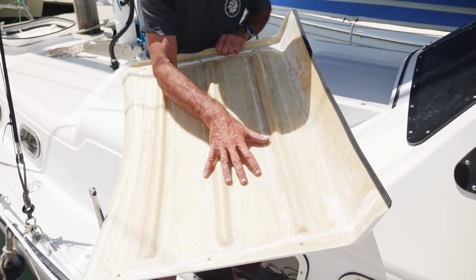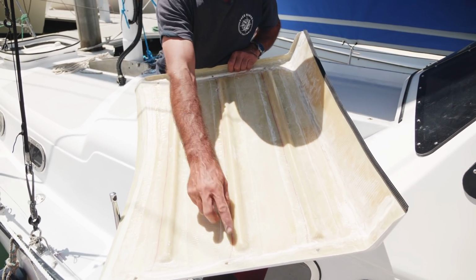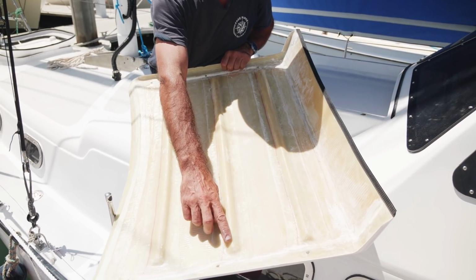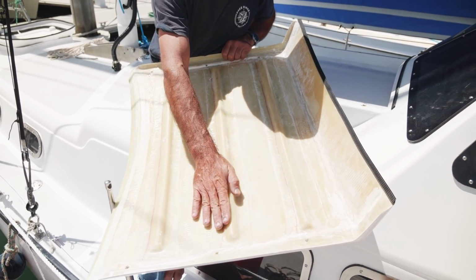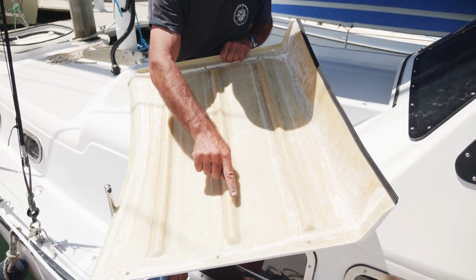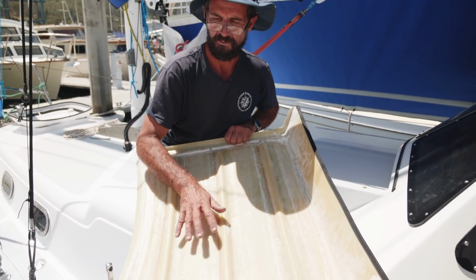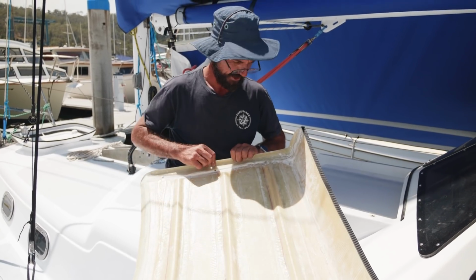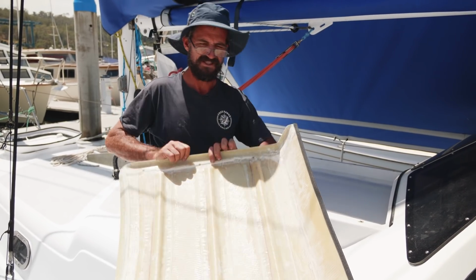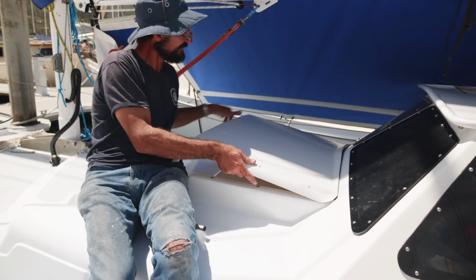We didn't want to add additional weight, so this is just 450 double bias glass, both sides. Then of course we molded these nice rounded shapes out of the same foam and just hot glued them on and used that as a form to put this tape over it. Okay, that's 100mm tape laid over, and that curved surface this way and this way makes that incredibly strong without much of a weight penalty. And of course this is very smooth, it's as smooth as packing tape, so it really mates on this exactly, it mirrors it. So when it actually goes on,